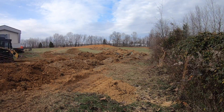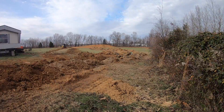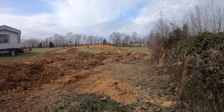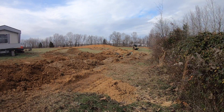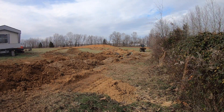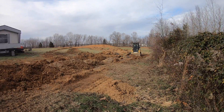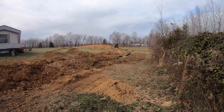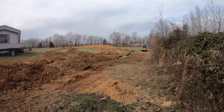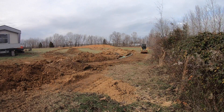I'm using a lot of the pea gravel I dug out of the trenches to backfill the initial edges and corners of the chambers. That extra pea gravel alongside the chambers will give a little bit more volume there for effluent, and also make it easier to pack in along the sides of the chambers to give them proper support before pulling all the other dirt on top of them.